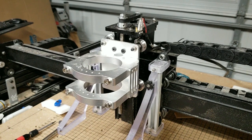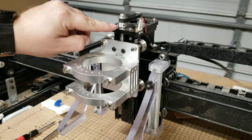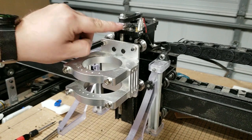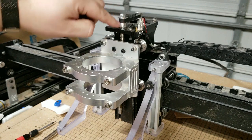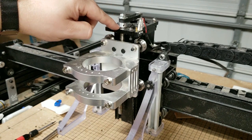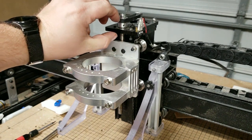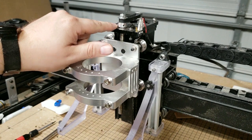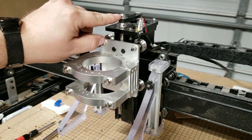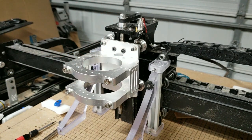Let's get started. This tip is going to be helpful for anyone who's having issues getting the top nut tight enough. This top nut has to be tightened all the way before you tighten the set screws on any pulley, because the function of the nut is to put force on the pulley down against the washer, against the inside of the bearing, and pull the lead screw up against the bearing. There should be no play in that. A lot of people are having issues with these set screws falling out and the pulley slipping, but a lot of it could be alleviated just by having this nut properly tightened.